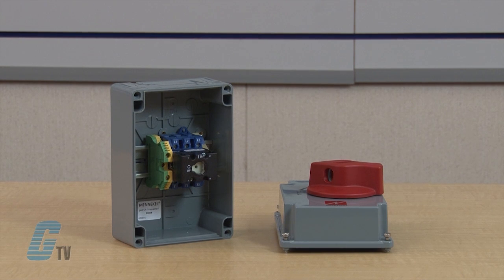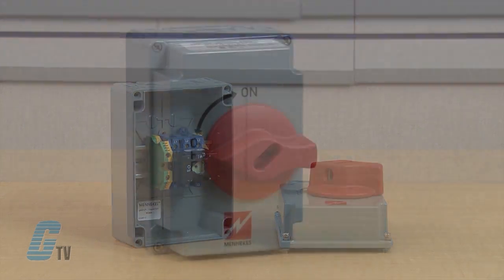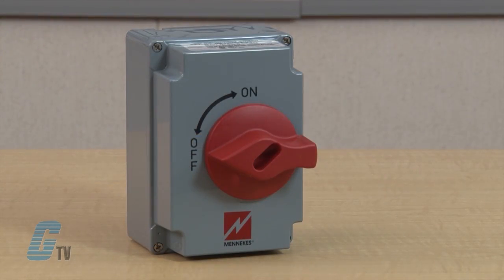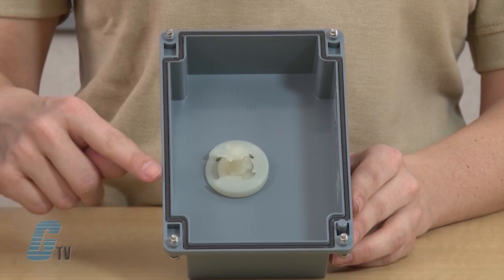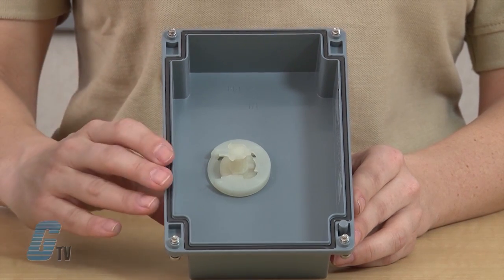This impact modified enclosure is resistant to many chemicals and made with UL94 5VA and V0 flame retardant material. The enclosure and handle materials are UV stabilized. The gasket is poured in place and never pulls out, for a long lasting seal and protection from harsh environments.